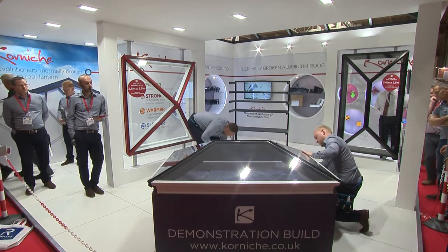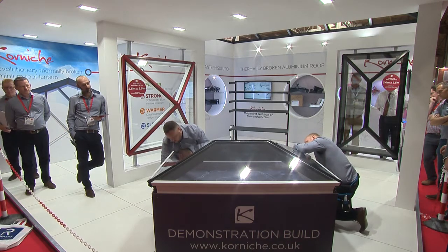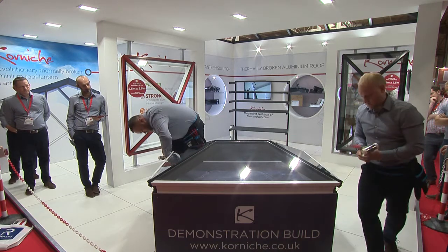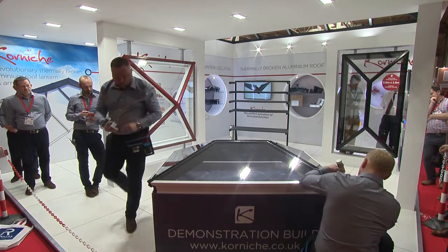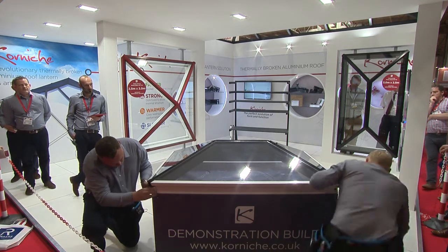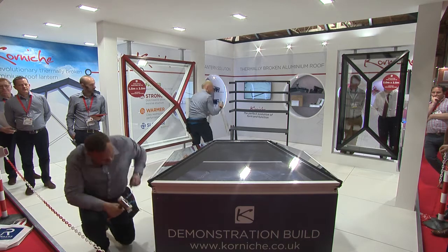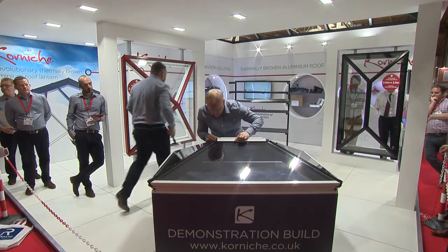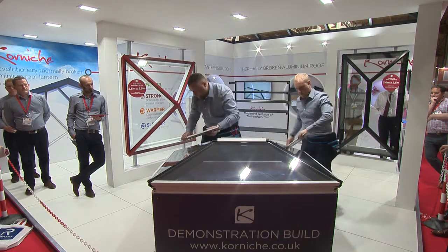Now the inner corner casting's going on. Once each one of those is in place, you should see it's got a slightly raised profile. It actually locks that glazing retainer in, and it's just hammered home with some one-hit fir tree clips. Next, the ridge top cap goes on. Just all clip fit, no tools required for that. And the same with the hip top caps.